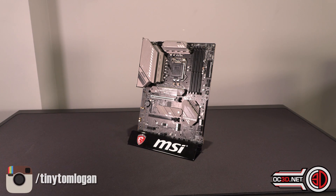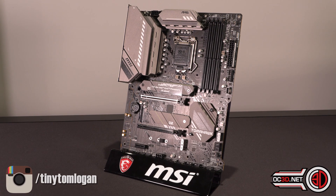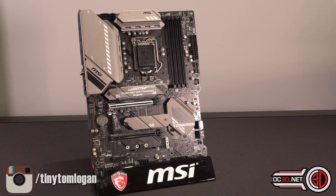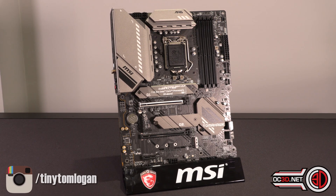We like the gun metal grey aesthetic, it keeps it understated, and the stickers over the heatsinks and across the board aren't too bad either. It's just one of the more expensive B560 boards, so you'll have to decide whether it fits your budget. If you're thinking about the 11400F, maybe go for a slightly cheaper board and save some money — the VRMs will be over-specced. However, you might be buying this for the extra NVMe heatsink and better rear connectivity with extra USB ports. There are cheaper options from MSI within B560 if you want to keep your budget balanced.